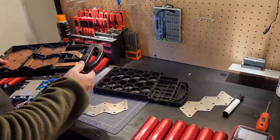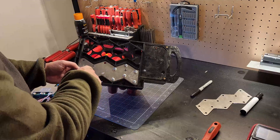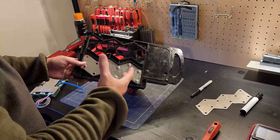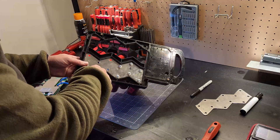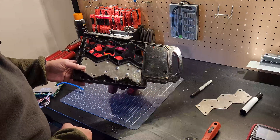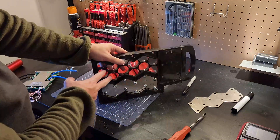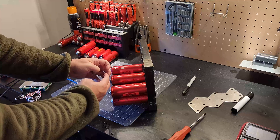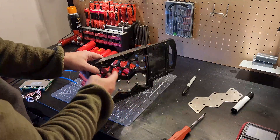We've got our first six cells in place. I marked this side as positive and that one as negative — you need to make sure your path is correct as you're building to avoid accidental shorts. With six cells that's potentially a thousand amps that could rush through things, so be very careful. I went ahead and marked this one positive and this will be negative, then we'll wire that up and do the second side too, double-checking alignment before moving forward.